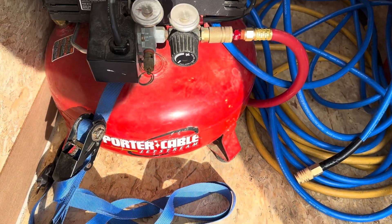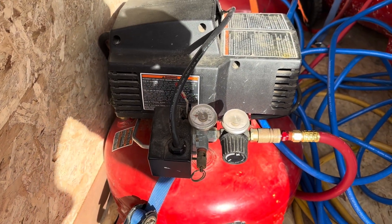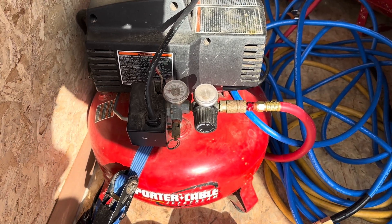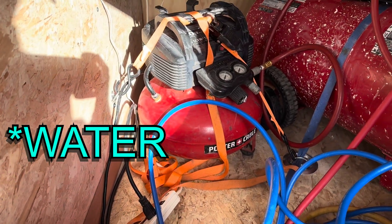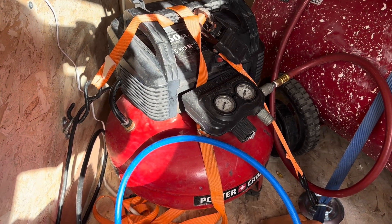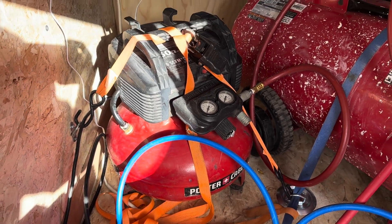Here's another type of air compressor — a little pancake air compressor. They're usually around six gallons, sometimes smaller, sometimes a little bigger. These will work, but it will take you a long time and it's not guaranteed to get all the water out. For most home applications it's acceptable, but if you're going to do a lot of blowouts, go with a bigger tank.